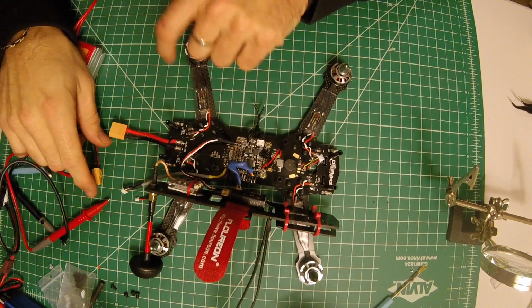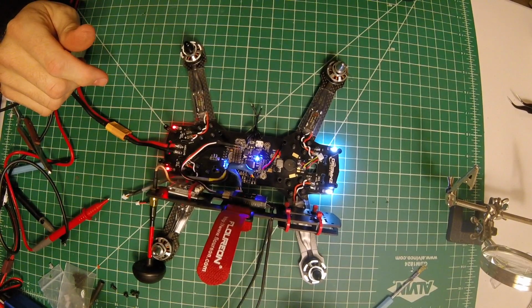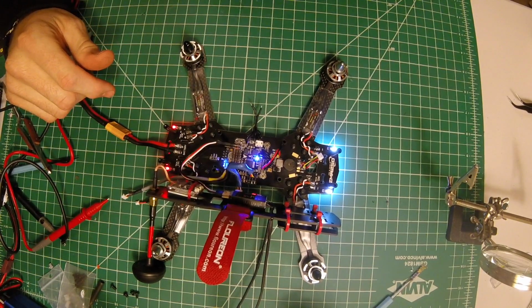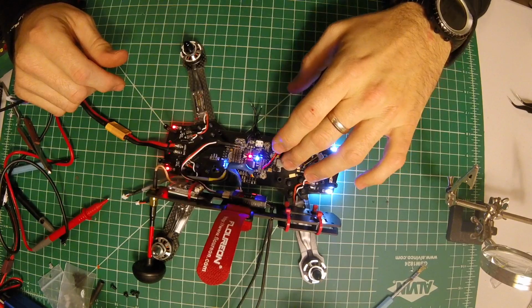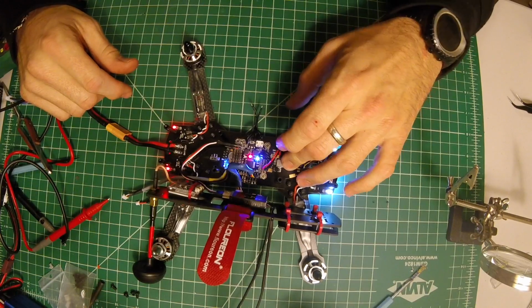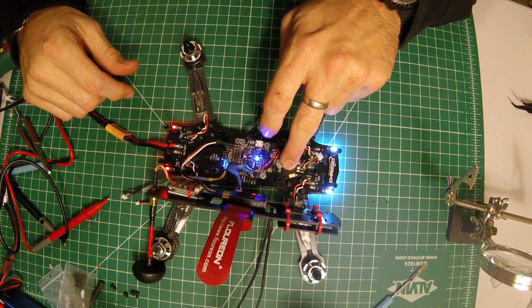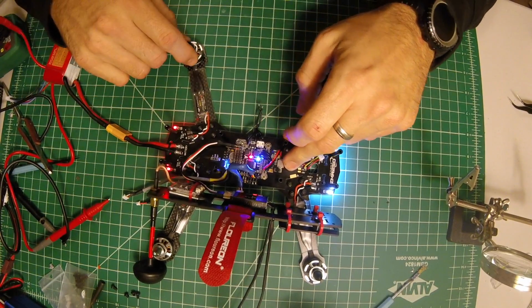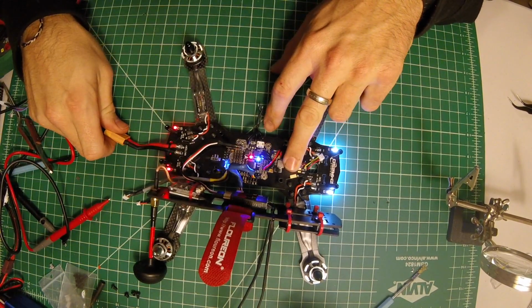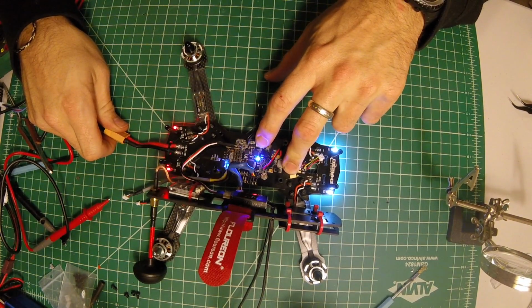And antenna connected. Yeah, okay. Well, let's see what happens. Yeah, I mean, that's gotta mean something, right? But I don't know what it is. Power's coming to just about everything. I might bring the computer over here to the bench and turn this beeper off so I can play with it, see if maybe the camera VTX works, all that, because the motors are controlled by the flight controller. So this might just be something I don't know about bringing up a quad, and clearly the way I had VBAT wired was what caused something to short, but we'll see here in a little bit.